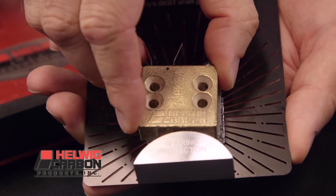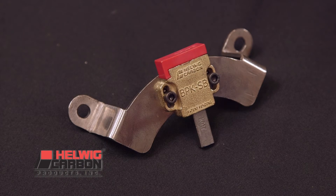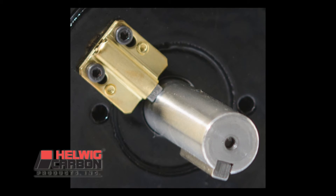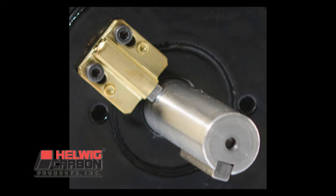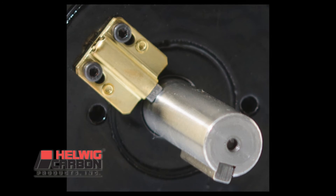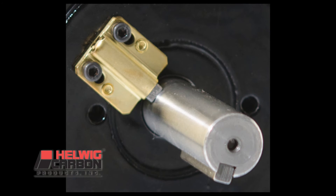And it stands up to almost anything. For those who prefer the kit to be mechanically fixed to the motor, we do offer mounting screws within the same kit. You simply drill and tap two small holes and screw our kit onto the motor. They can be installed internally or externally. Virtually everyone who has a motor connected to a VFD is a candidate for the bearing protector.